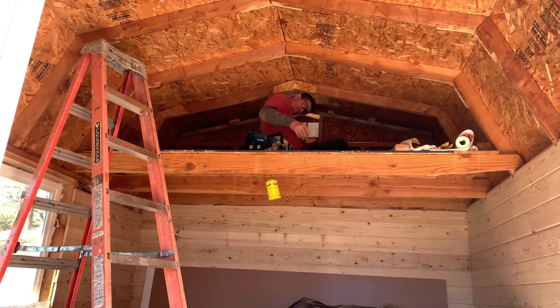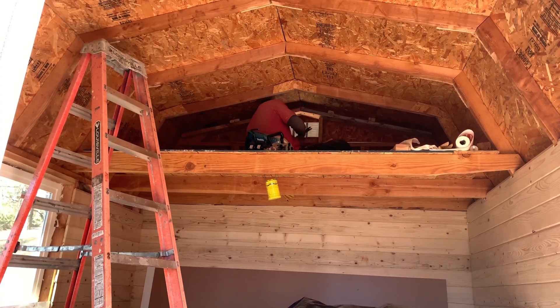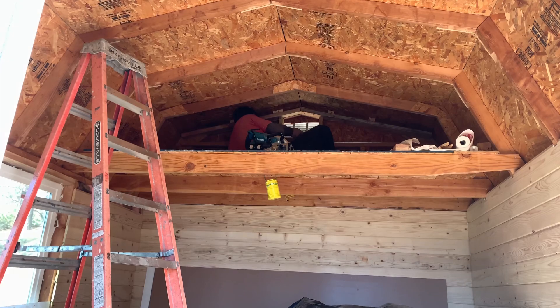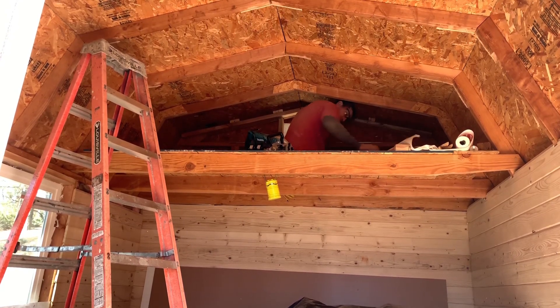I did spend quite a bit in lumber. I'll have the prices for what I spent on the knothole pine. I've already put in some of the spacers here. I haven't done the insulation or paper on the back wall. But as you can see, that upper vent was already installed in the tough shed. So I'm framing around it so I can add a little trap door for that — in the summer I can open it, and in the winter I can close it.